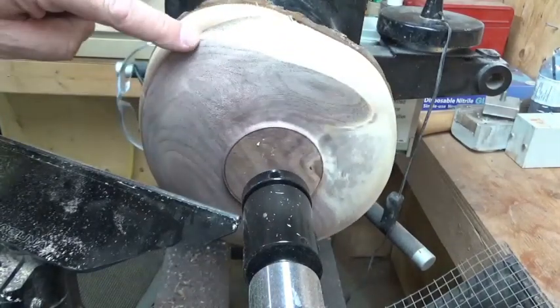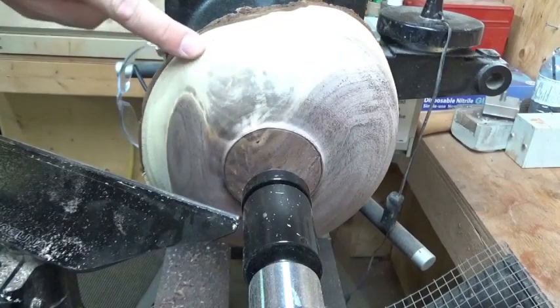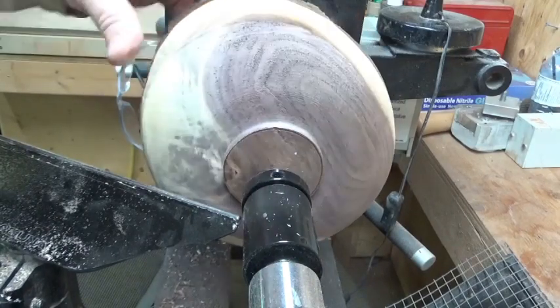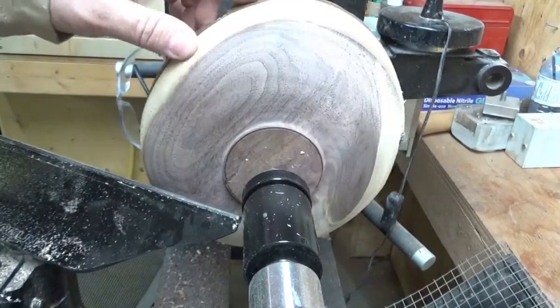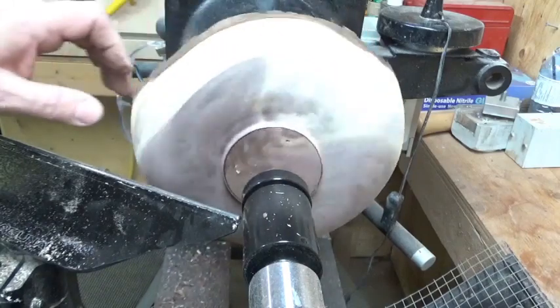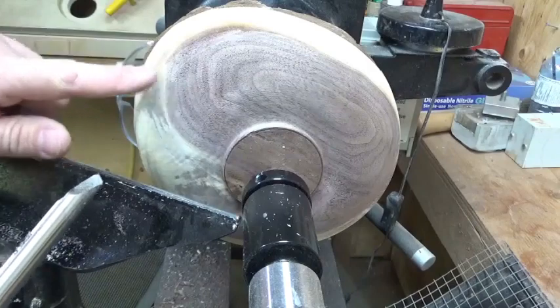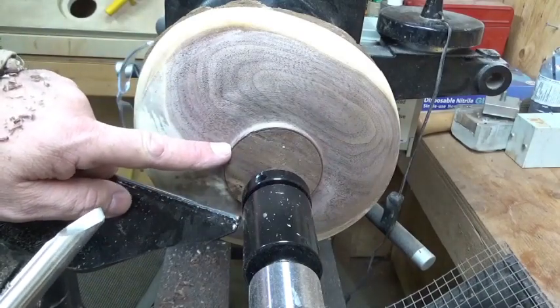You can see how much it's warped by how much material it's removing here and how much it's not removing there. It tends to push out into the end grain areas and sink or reduce at the side grain areas. I'm going to go with a push cut around this corner and then come back and create the dovetail.